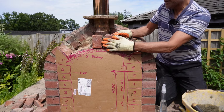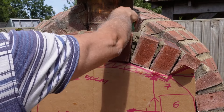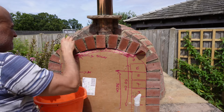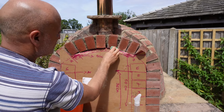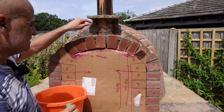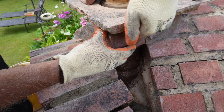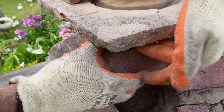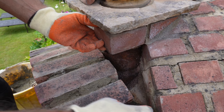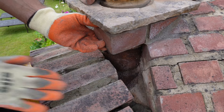It's back in now. I'm ensuring that the new bricks are aligned with the outside of the old bricks, which they are, and they look good. I'll move to the other side. I've just finished the other side as well and it looks pretty good. At the moment I'm just roughly cleaning off any cement I've left behind, because if it dries it's more problematic — it's easier to do it now so I can point them once I've done the rest. This plate section will need approximately one centimeter clearance, and I'll be filling all of this gap with cement which will also strengthen the bricks on the outside, then I'll do some cosmetic work on top to put it back to what it was.